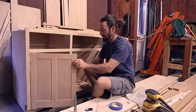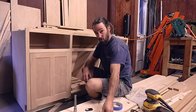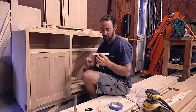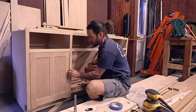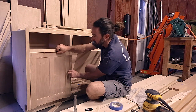This door here is already done and it has a nice fit. First of all, what size gap do I want? I want a 3/32 inch gap all the way around the door. So the first thing I did was to rip a bunch of little gauges, little shims at 3/32 of an inch, so I can use them to see how well things are going as I'm fitting.